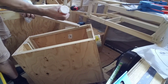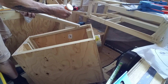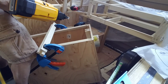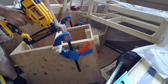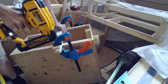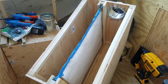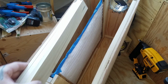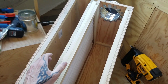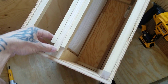After I installed the guide track for the filter, the last piece on the track just sits over the top edge of the filter when it's in place and holds the filter securely. I glued that piece and tacked it in place with my brad nailer. Then I put the filter in its track — I had to cut a filter and tape the edge because it's an 18x24 filter and my local box stores don't carry that size right now, so I cut it temporarily and slid it onto the track.